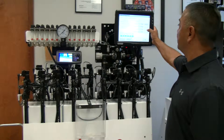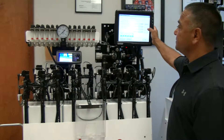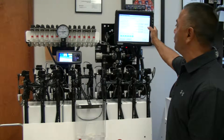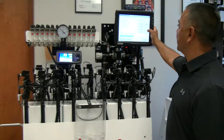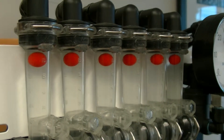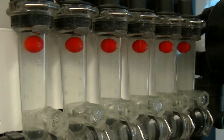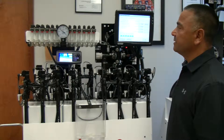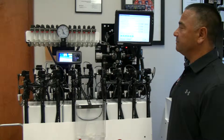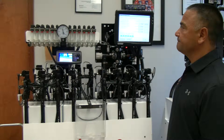If I speed up to four, five miles an hour, see my rate start to come up — I'm not struggling because there's no check valve to open. I immediately go up. I can go to six, seven, eight, nine — it's already shifting — ten miles an hour, doing five gallons an acre, and it's all being managed efficiently without any problem.